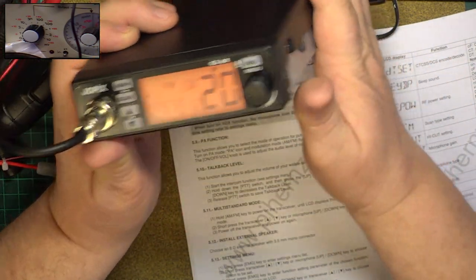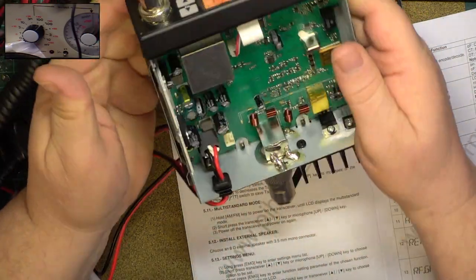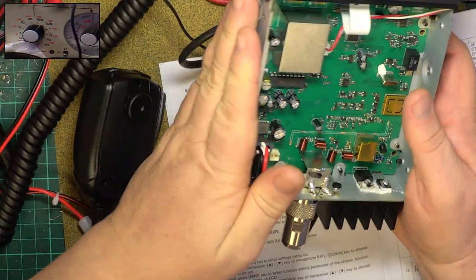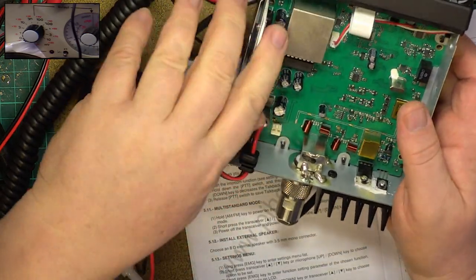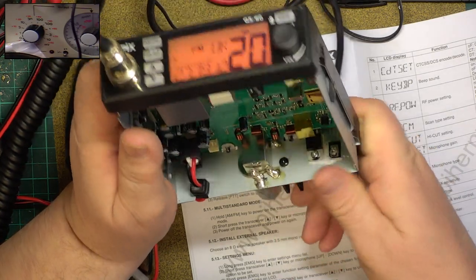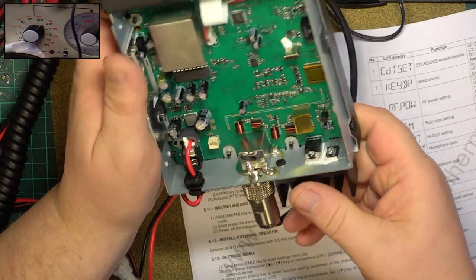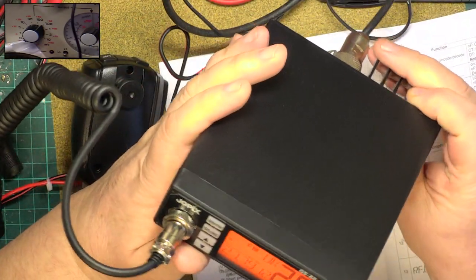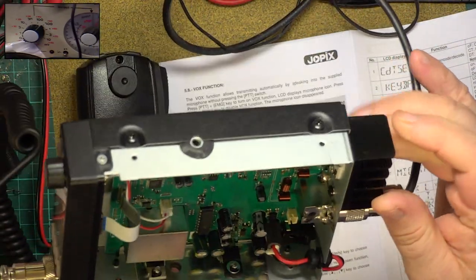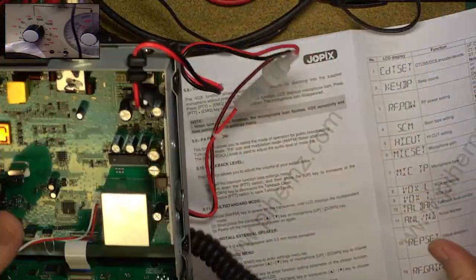The radio seems to be capable of a bit more, but you've got to take this with a pinch of salt, because I can tell you that that is hotter than I would like on where the power regulators are, whereas the transmit heatsink, it's hardly anything at all. But it could be a 12 watt PA. I don't know what they reckon these are in some kind of dodgy export mode. But anyway, that's where we are.